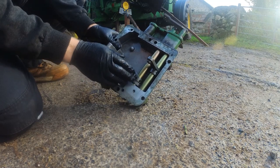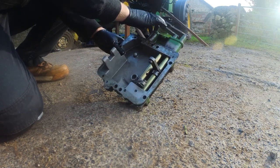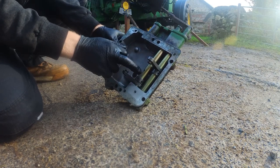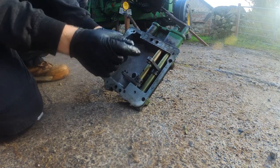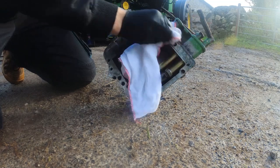But I've seen on farmingforum.co.uk that it's very common for a pin to snap on these John Deere 6000 series, especially the earlier versions, as mine is, because they only put one roll pin in it, whereas the later versions, they put two, one inside the other, and they're kind of a built-in redundancy there. But anyway, did a bit of ripping, had a few other things to investigate.